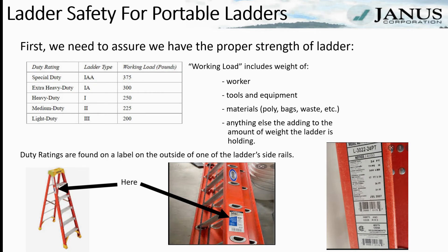It's important to assure that the ladder we use can hold the weight of the activity we're conducting — loading materials and equipment to a platform above or below, scraping paint or fireproofing, or anything else we're doing on a ladder. Remember, the workload includes you, the tools and equipment or supplies, materials being carried, and anything else that is on the ladder at the same time you are.